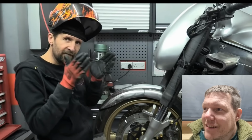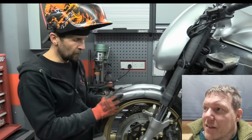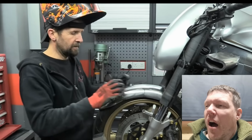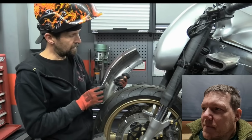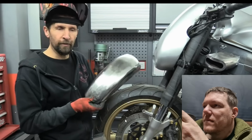Just a little bit because they flared out just slightly, which is quite natural when you're pushing anything in. I didn't want to bring these slits up any higher than I had to, because there's more to weld up. This way I can just squash them back in, and now all I've got to do is tack weld those back up. Now it's got facets though. Unless that's what you're looking for. And then make them look good.